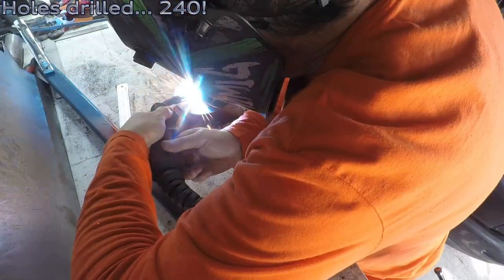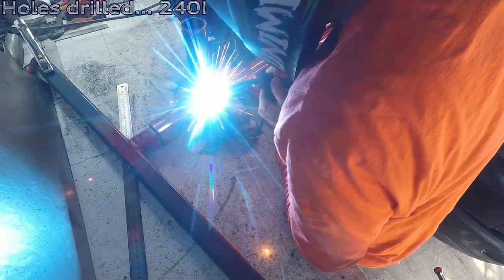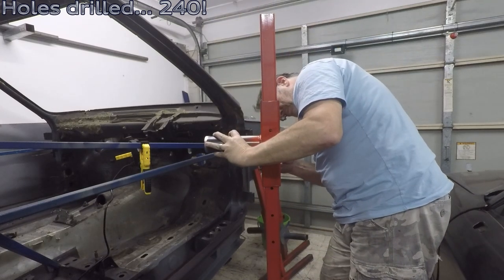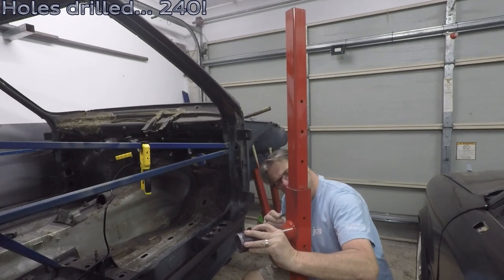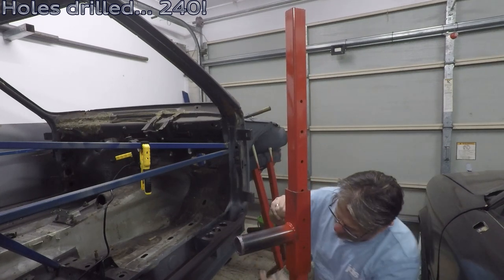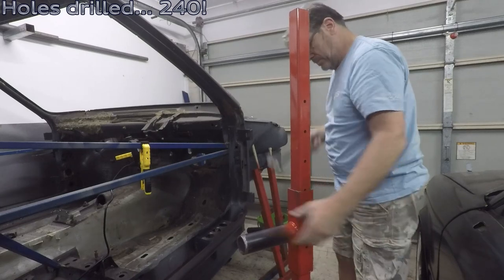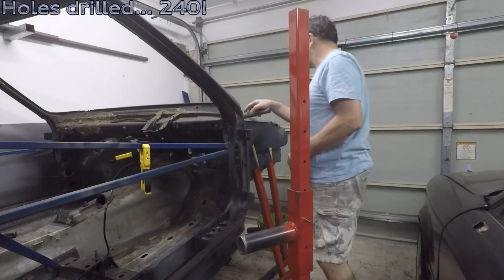So all the main fabrication is almost done. After plenty of cutting and plenty of welding, this is how we look. The outer sections didn't fit very well over the inner, so I did have to weld some spacers in — and now they're pretty tight with very little movement in them. These holes are pretty tight as well. Still not made my mind up whether I'm going to drill them out or not, because I'm not going to be moving them very much. The advantage of them being tight is it's not going to wobble all over the place.